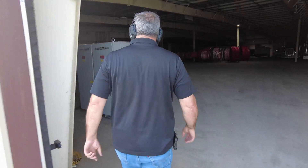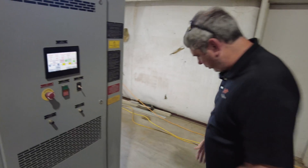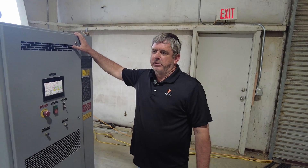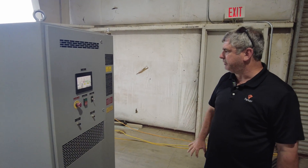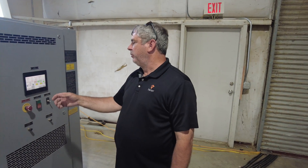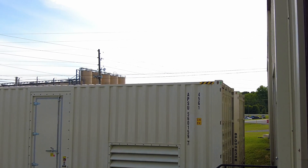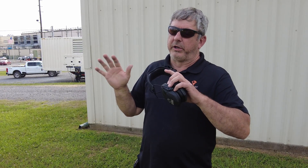So we've got a 650 kW load bank. Obviously if we had four megawatts of power — which these cables are capable of producing, four million watts of power — this load bank can only accept 650,000 watts, so that's why we only have two sets of parallel cables hooked up. We just added 650 kW load to both units, so each unit only gets about 300 kW. The two generators are working themselves out so they provide roughly half the amperage each.